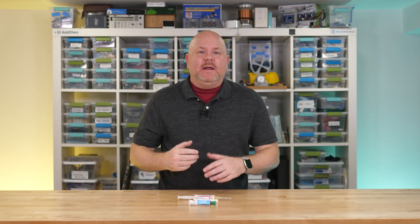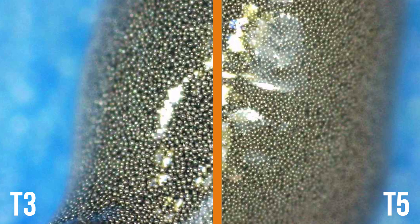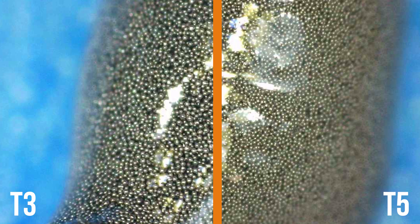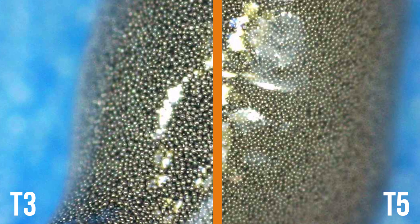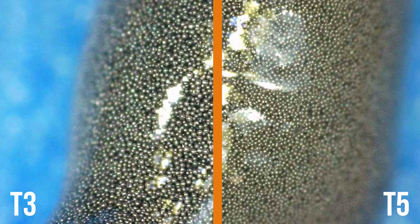The size of those particles are rated with numbers like T1 to T6 — you can find a chart somewhere else on the internet. Bigger numbers mean smaller particles that fit through smaller holes in a stencil. The MG paste I'm using has a particle size of T3, and it is usable for pitch sizes even on a QFN package, but I'll show more of that later.